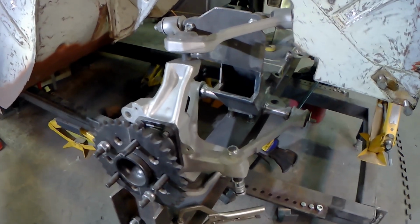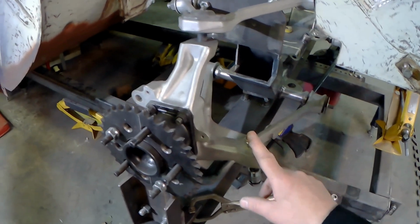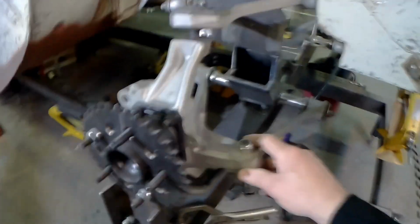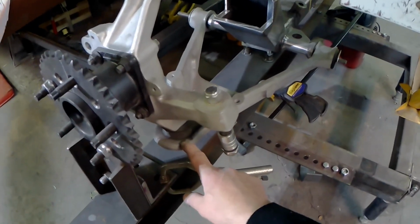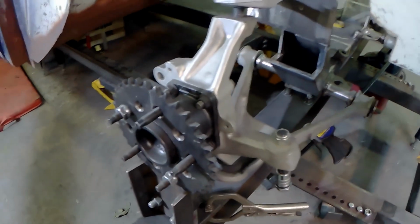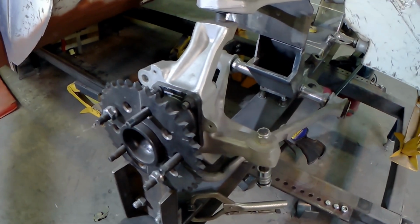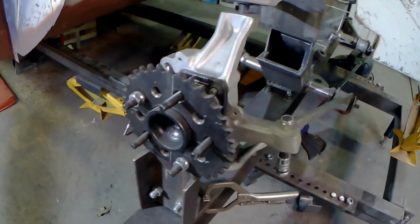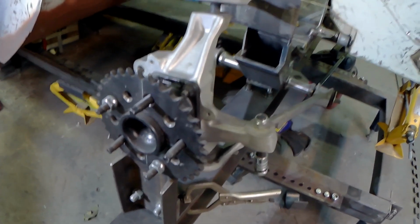So the Corvette C4 stuff actually is very good. The only thing we'll modify on this, other than to change the ball joints out to new parts, is the lower ball joint is going to be a Howe Racing part. It's half an inch longer, which effectively makes the upright a little taller, which, if you're a nerd and you follow these things, is essentially what happens in the C5 and C6 Corvettes. And if you've ever driven one of those things in anger, they handle very, very well.